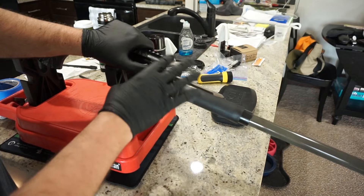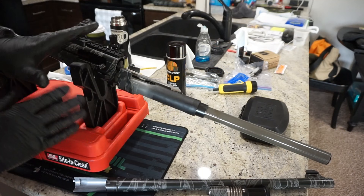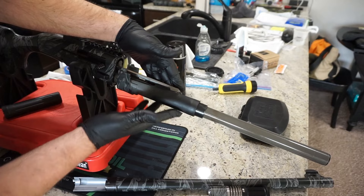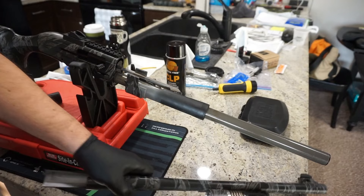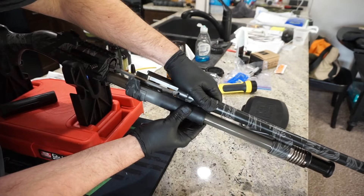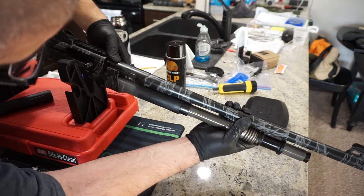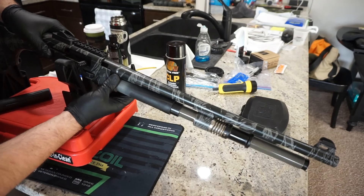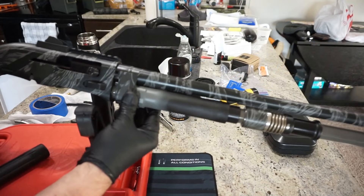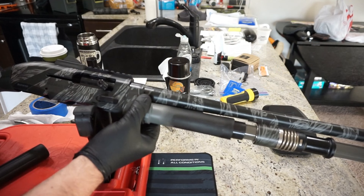This is going to be the trickiest part of putting the barrel back on. You want everything to rest back once assembled, but it won't happen right away. What I did was take the spacer and pull it down about halfway. You're going to have to move the spacer back with the barrel at the same time in order to clear the molding up here. Go ahead and put the barrel over the tube — guide both the spacer and barrel at about the same time, keeping this part down as you pull back. Give it a little wiggle. Pull back a little on that charging handle to take the tension off, reseat the barrel, and you're good to go. If done properly, you should have some free movement — that's totally normal. When we put the hand guard back on and put the magazine cap on, it's going to keep everything braced to the rear.